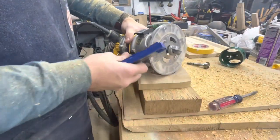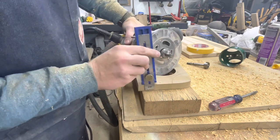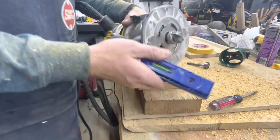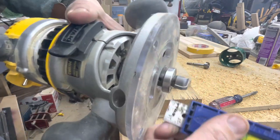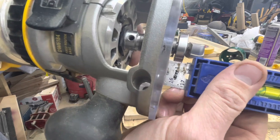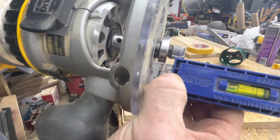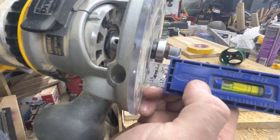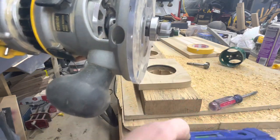At our router, we want to measure our first cut to the depth of our template. We want to make sure that where the blade starts, it's within our measurement. If not, there will be a chip-out area. So we just want to make sure we're right inside of it, and then we can gradually move the bit down.